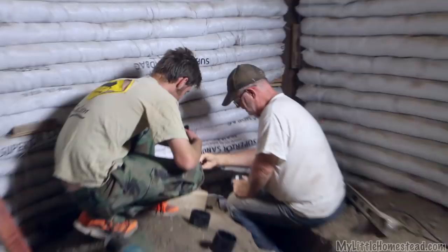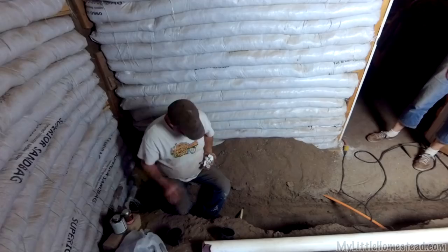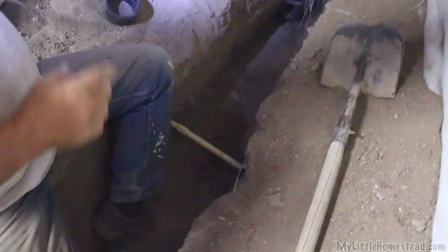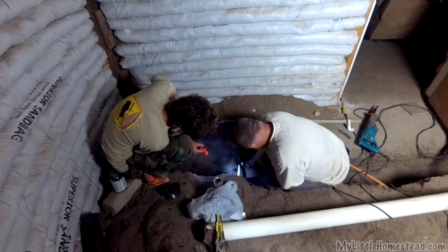Since those pipes had been buried we couldn't tell, but it turned out that was the hot water line. Brian Garen came home with cold water PVC and so it didn't fit. We cut it last night and then realized we didn't have the proper tools because it was a hot water line and not a cold water line. But miraculously we were able to find a connector, so we put that in — but we didn't get it all the way on. We didn't realize that, and when we came back and turned on the water pressure it leaked. So we didn't have water all last night.